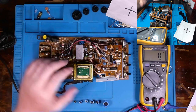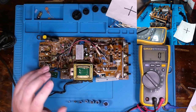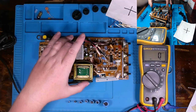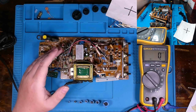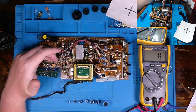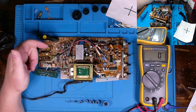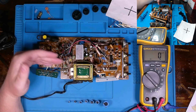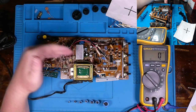Okay. Now, after capacitors, the next thing I'll check, and this is typically if the device will now power up and I'm still missing functionality, is I'll start looking at ICs and checking pins. Why? Well, because they're all going to have a VCC or a VDD and a ground, something along those lines. I can check the voltages there. If there is a signal or something, I can use my oscope to check that. So I'm looking for data and stuff.